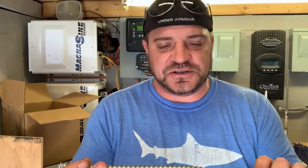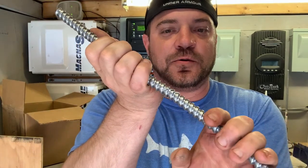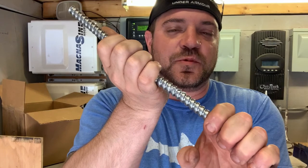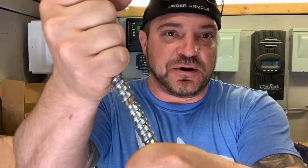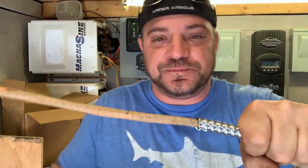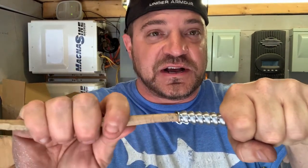After you have your notch cut and your groove from your hacksaw — as you can see right there, I'm through about two of the rings — you're going to twist your hands apart, going clockwise one way and counterclockwise the other, against the rings. That's going to snap it open just like that, and then you can simply pull it off.